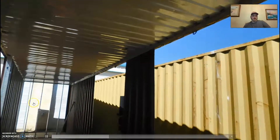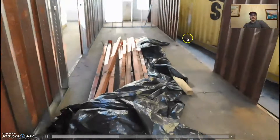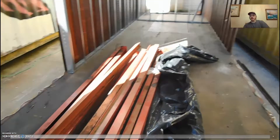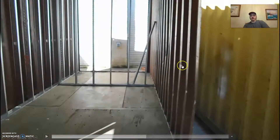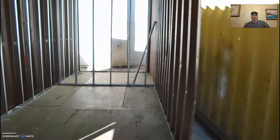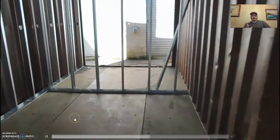This is interesting — I have very resourceful builders. They went and traded some of the metal pieces they cut out at a scrapyard for some support beams. There's some surface rust on those right now, but they're going to work perfectly fine. Both sidewalls of the two containers being pushed together — that interior sidewall is going to be missing — and so we're going to use those steel braces across the top to give it some extra support where we have that long span once those sides are cut out.